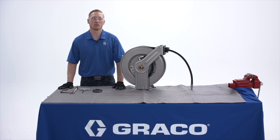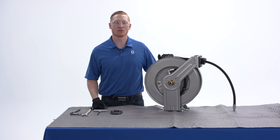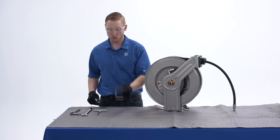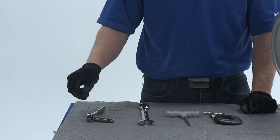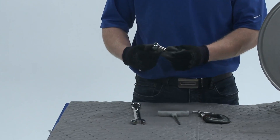The process is the same for all of our different models. Before starting this task, make sure you follow the pressure relief procedure that's listed in your manual. The tools we need are a small C-clamp, a 5mm Allen wrench, a 22mm wrench, and a 10mm socket and ratchet.